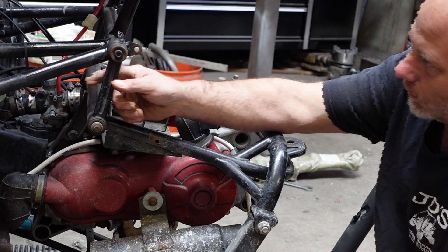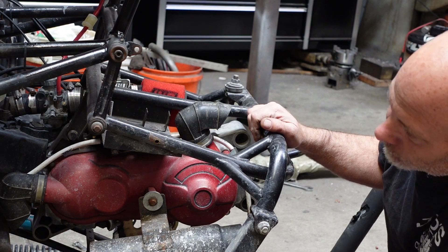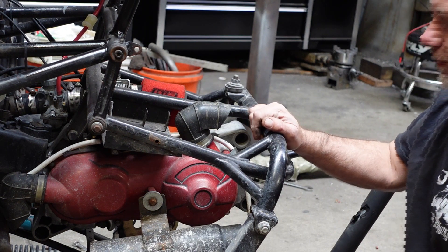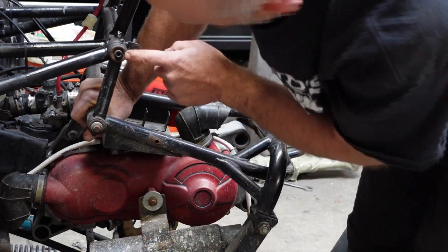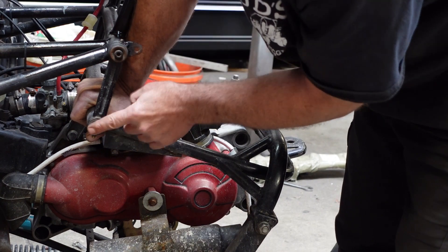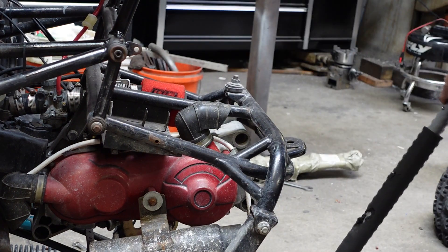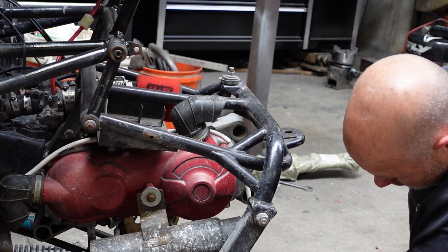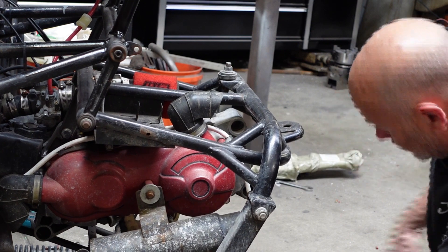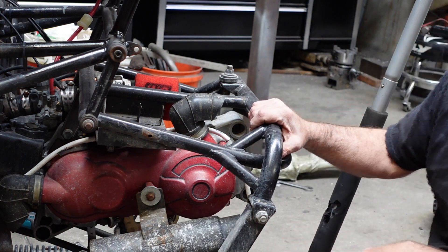You can see the wiggle — that's the bushings; they're completely shot. That'll have to be something I tell him he's gonna have to address when I get this all done. But I'm confident — you can see if you drew a straight line down the bottom bolt in front of the top bolt. I'd probably go a little more — that's even safer.